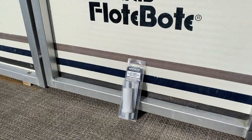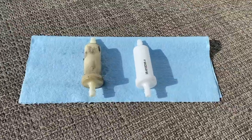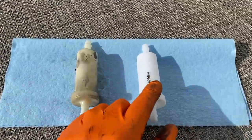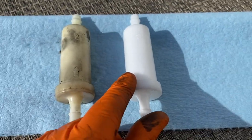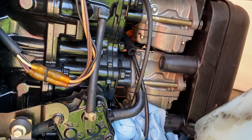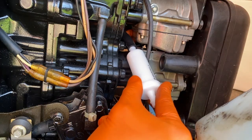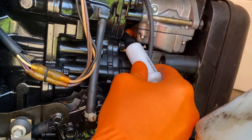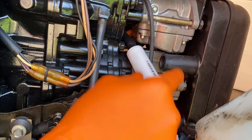Making our way to the front of the boat and to the brand new filter — there is the replacement part number, OEM Quicksilver, as you see right there. Here's a closer view of the comparison of the old filter on the left-hand side and the brand new filter on the right. You want OEM, however down below in the comments we will have a few options — OEM as well as aftermarket. There's the arrow right there. Back to the engine: I've got my left hand and thumb on the back side of the fuel hose to support it as I insert the fuel filter, carefully inserting it until it's all the way flush on the hose.